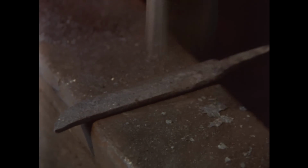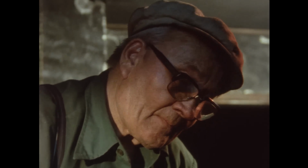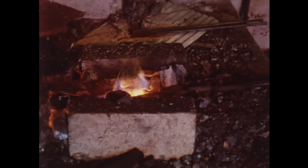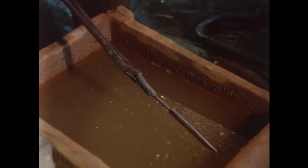Tempering is a phase of work that affects the final quality of the blade. When the blade is red like a cranberry, it's the right temperature for tempering. If tempering is carried out too hot, the steel remains porous, even if it has already been forged solid. Tempering with soft water gives the best result. Oil doesn't temper so sharply as water.